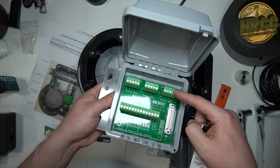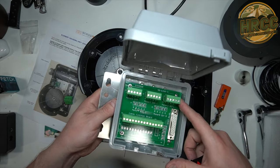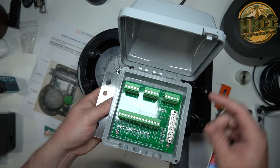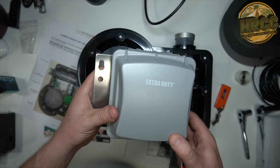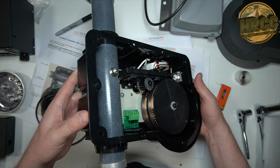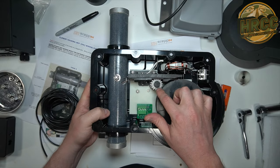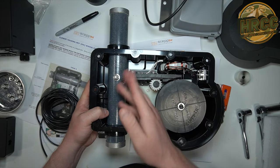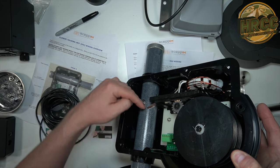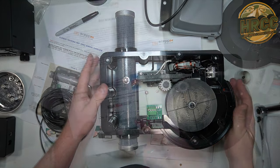This is an upgraded component. You've got your driven element, director, and reflector, and then that connects to the motor control, which goes down to the box that actually controls the antenna in the shack. There are two tapes on these spools, and this stepper motor with the teeth is winding and feeding them out and feeding them in. The pipe is cut at an angle so that one goes this way and the other goes that way, and that's what controls the radiating element.